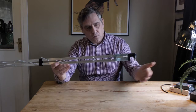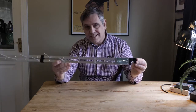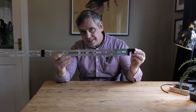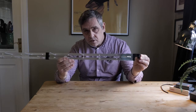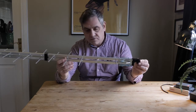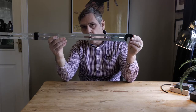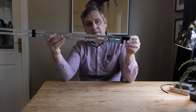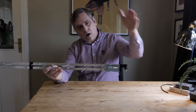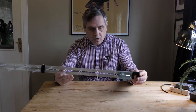Because there's no rear reflector on the back of the boom arm, it will fit into the smallest of spaces. So for example if you're fitting it under the eaves, or under some sort of joist or beam in the roof space, you've got a lot more versatility in fitting this aerial into smaller spaces where an aerial with a large reflector on the back would be much more difficult to install.